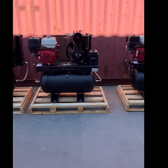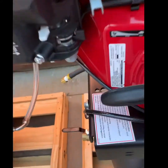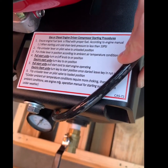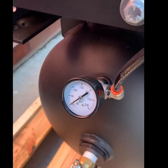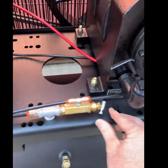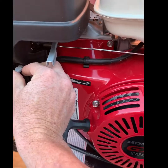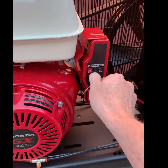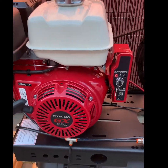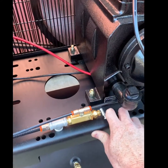We will now use the electric start feature connected to a battery that is mounted to the compressor. Starting procedures are listed on the compressor package. Make sure your tank pressure when starting cold is below 10 psi or 50 psi when starting warm. Unload the compressor package, set your choke appropriately, and engage the electric start feature. Reset your choke, load the compressor package, and now your package is fully functional.